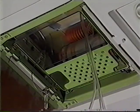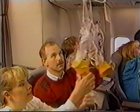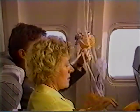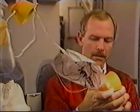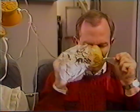The passenger cabin of the Boeing 767 is equipped with chemical oxygen generators. Pulling on one mask releases a pin, which activates the generator to allow the flow of oxygen to all masks attached to that unit. Once started, the flow will last for approximately 12 minutes and cannot be turned off.